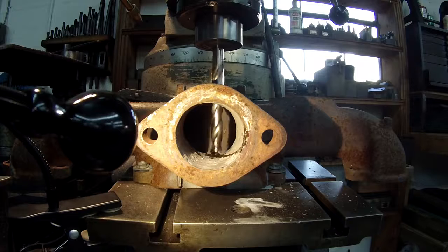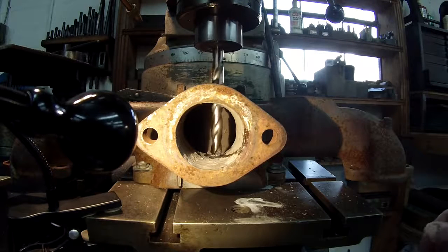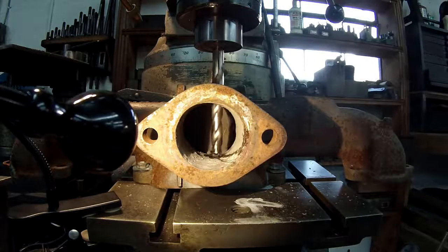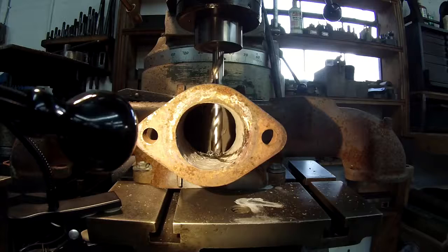Yeah, it's tough, I can tell already. You don't normally want your cutting tools to just dwell, but I'm taking it very slow, just hoping that that drill is just chiseling away at a center point there to keep it straight. But I can always regrind it if it messes it up. No biggie. Seems to be doing pretty good now.